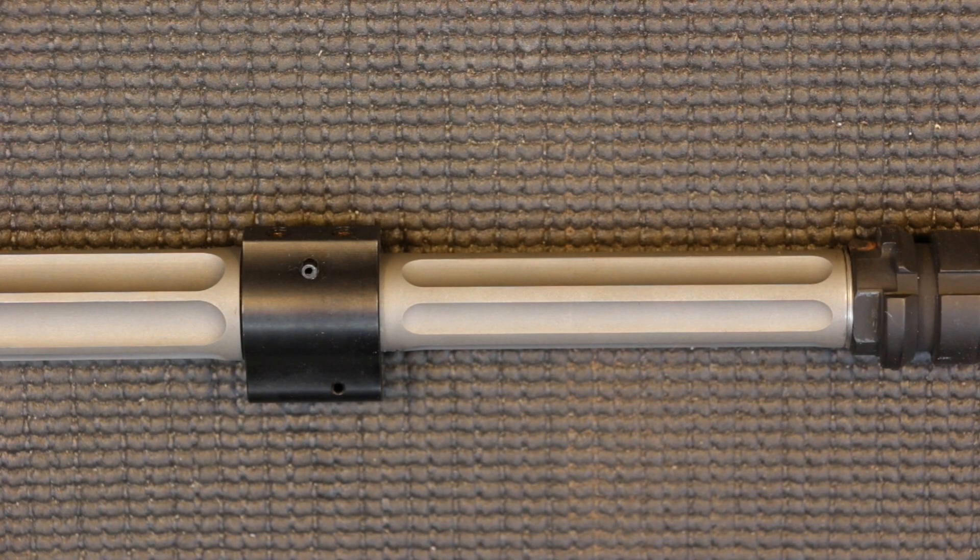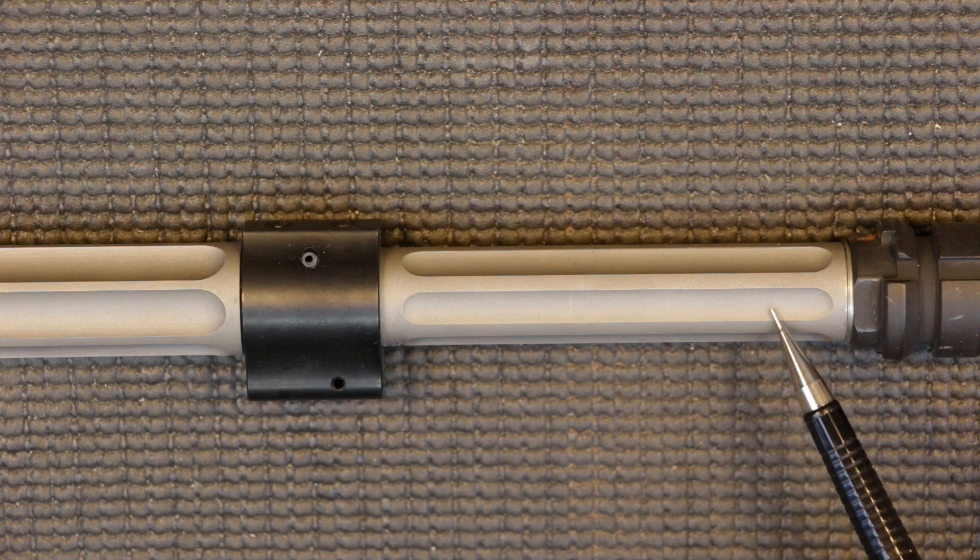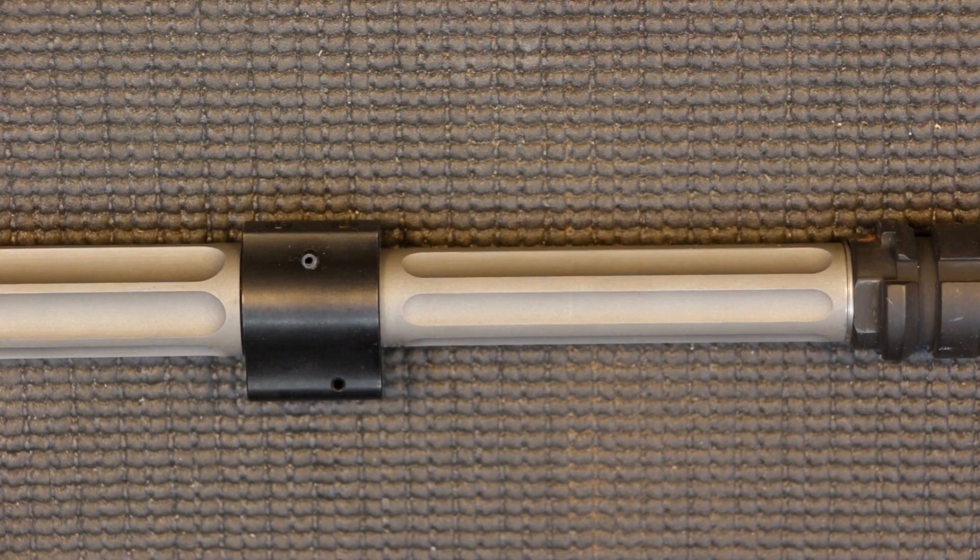One of the major advantages about this barrel is that it is fluted — a six-flute design from Ballistic Advantage. One common misconception about fluting is that it adds rigidity to the barrel, but that's actually not true; it's the reverse. You actually have a slight loss of rigidity or stiffness by removing the material. The offset advantage is a substantial weight savings. Given that this is going to be on a home defense rifle, I'm not overly concerned about high round counts fired consecutively where rigidity loss might matter. So the advantage for me is saving as much weight as possible with the fluted barrel.